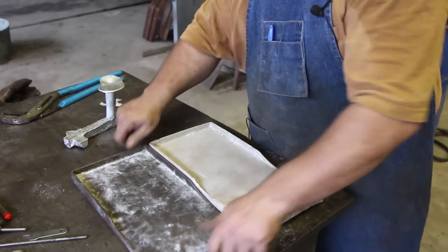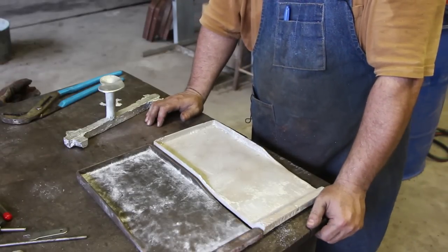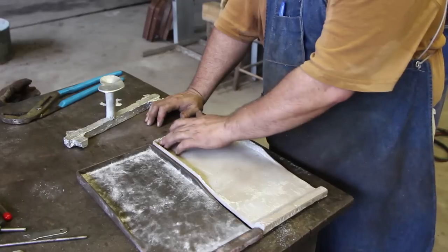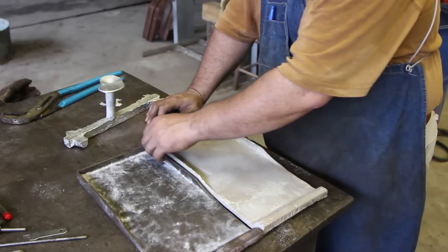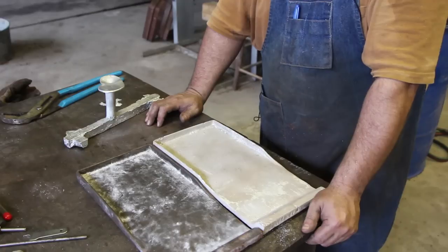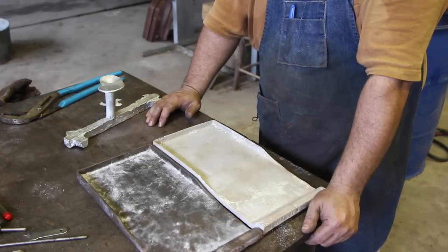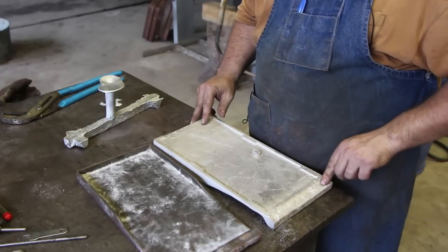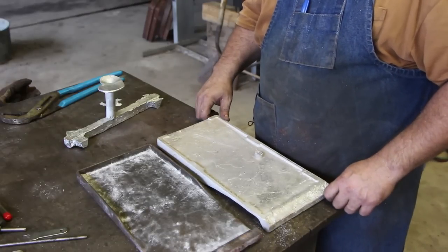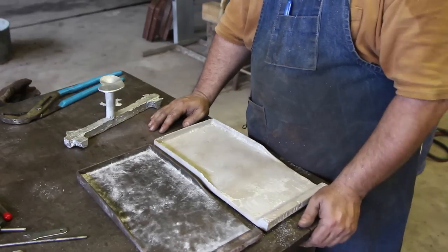Here's the original piece and the new piece side by side and I think for what we're going to do with this, this is going to be fine. I want to smooth this up — I got a few little defects around the edges where my sand kind of caved in. It was really hard to get this thin wall piece out of the mold. But yeah, I'm happy with it. So we're going to take this over to the milling machine — probably not today but in another step — we've got to mill a little groove in here that will fit down on there, mill this all flat, and of course mill this part here off. And this will be pretty much ready to go on there — put some primer and a couple coats of paint on there and I think it'll be just fine.